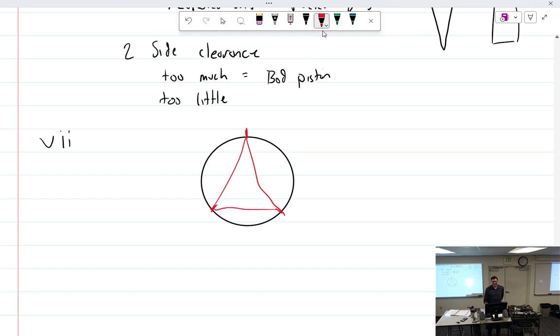Alternatively, you could stagger them 180 degrees, alternating. Both approaches are fine because the rings rotate anyway. But at minimum, think it through: you don't want to line all the gaps up. The math: 120-120-120 or alternating 180 out — both are acceptable.